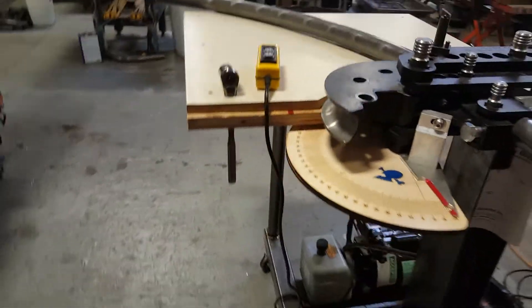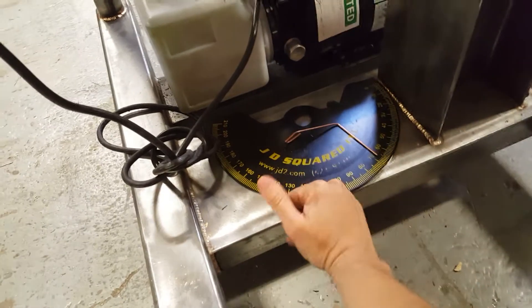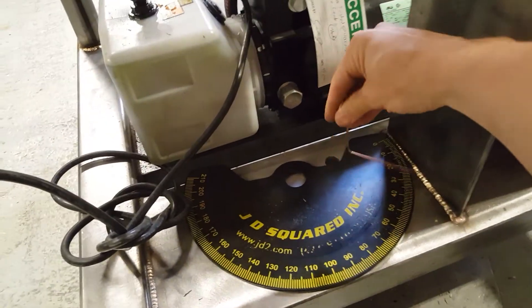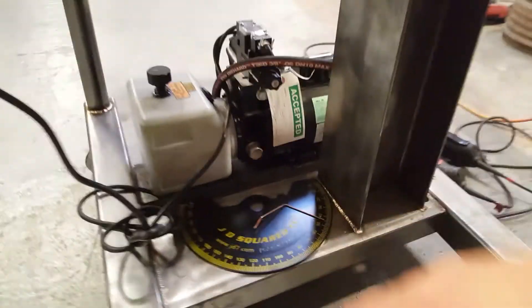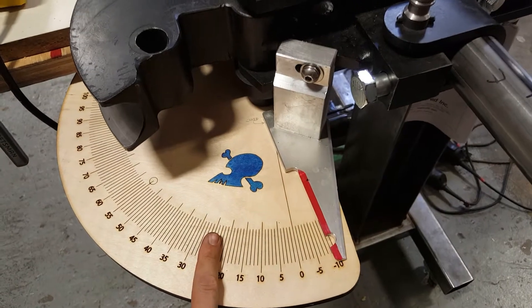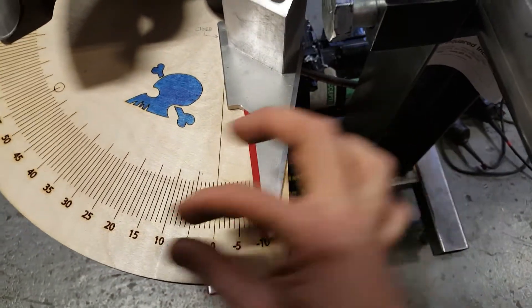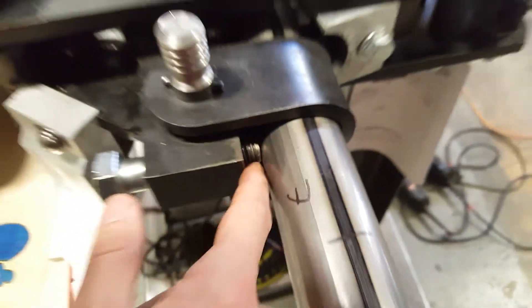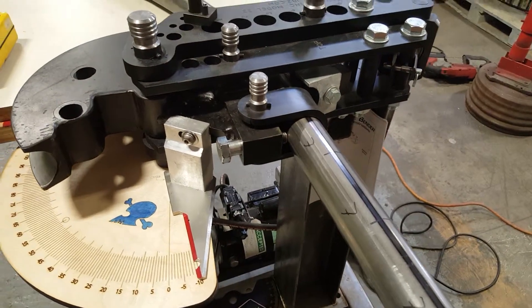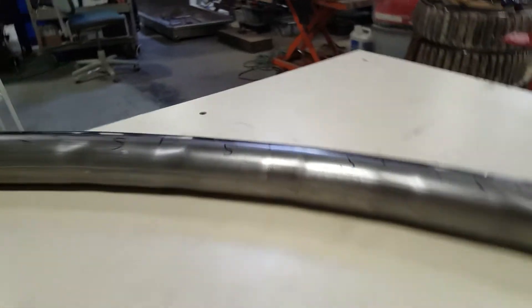One of the modifications I did: I built a big beefy stand. This was the original protractor and indicator on here — they actually kind of acknowledge it's a bit hokey. I didn't like using that, so I laser cut and etched a new one and machined this little block indicator with a little notch that shows me how much I've overshot the line. Another modification: this is the bolt that pushes in against the tube. I buttered up the tip with some silicon bronze and then turned it flat on the lathe — it's no longer marking the tube. It used to put a pretty good-sized gash in there; now it's really clean.